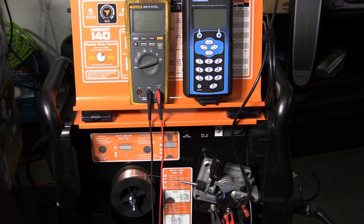I've done some more with the welder since then and I'm starting to feel that this welder has actually been underpowered from what I would expect. With 0.025 inch wire in particular the low wire feed speed really holds it back, and even maxed out, 0.025 wire is not nearly hot enough for even eighth inch material. I've seen people mention it's best to use 0.025 wire to get the most out of a 120 volt welder, but that's definitely not the case with this welder — it simply doesn't have the wire feed speed for it.